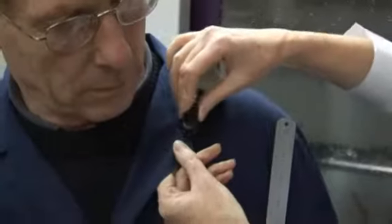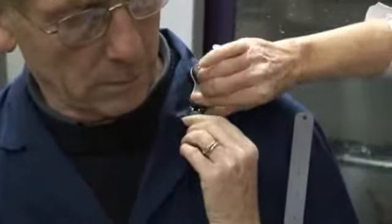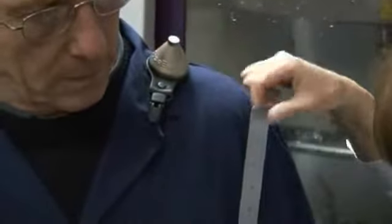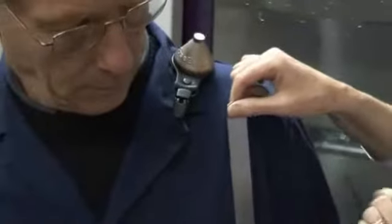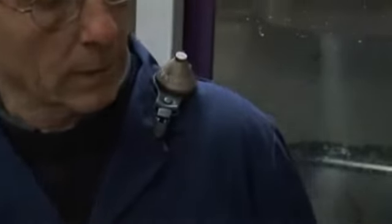position. When taking measurements using a dose badge, it should be mounted on the shoulder of the wearer within 10 centimetres of their left or right ear. Make sure that nothing can touch the dose badge, otherwise the measurements may be compromised.